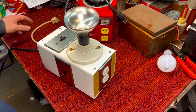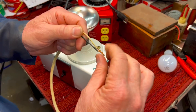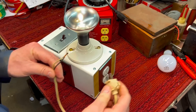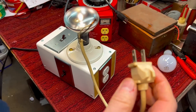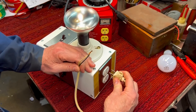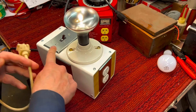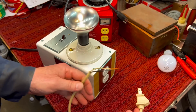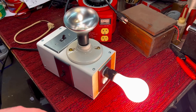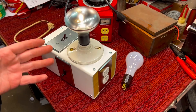Let me give you an example of why this is so interesting. I'm going to turn it on — now it's activated. I took a plug and twisted the two leads together. Normally if you plugged that into a regular outlet, there'd be sparks, a big bang, and you'd blow a circuit breaker. But look what happens when I plug it into this device — boom — it just lights the light bulb, because by shorting the hot lead it's creating a circuit. That's the beauty of it. It'll still power a regular device like a fan or light bulb. That is because it's a safety device, and that's why a lot of people use it — but I had to do it just to get my Variac on.